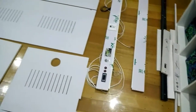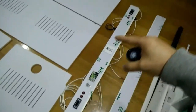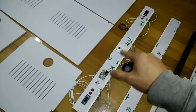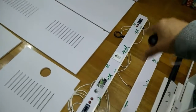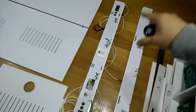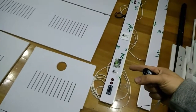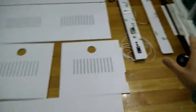Just to quickly run through the main components of the Brooder box. Think of it as a big box. That's your front facing, the top of the facing, which has all your control systems, your 7-day timer for the LED light, and then of course your two thermostat controls, one for the heat lamp and one for the fan. And that's the bottom rail, the bottom track where your perspex will be running on. So that's the top with a rail track there, and the bottom with the track there. Okay, so that's the top and the bottom, the face of the Brooder box.